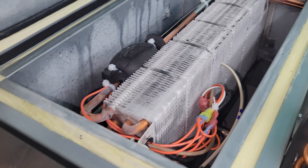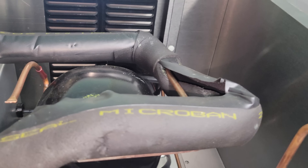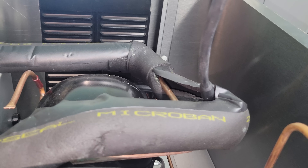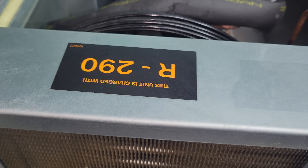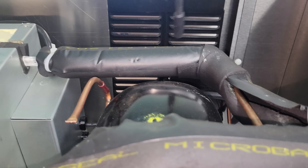I'm going over this thing and for the life of me I am not finding a leak. I even pulled back the insulation. Now the insulation itself sets off the leak detector, but I think that's the case on older leak detectors. I'm going to remove the insulation on the rest of that line and then thoroughly leak check just the line.